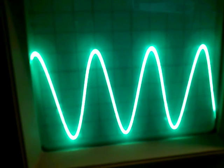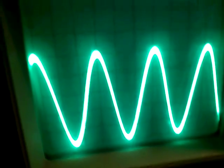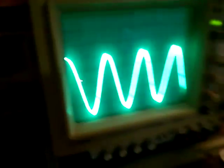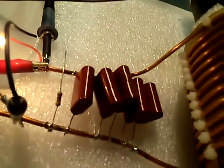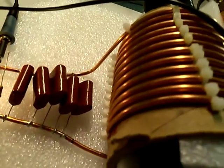What we have here is the resonant transformer output — that's the output here and this is the input. We're running about 20K, so 1K right there. This is a 14-volt incandescent bulb and we've got it tuned. The output is basically two Tesla coils.